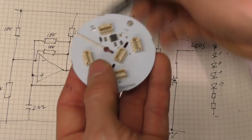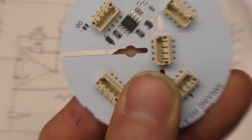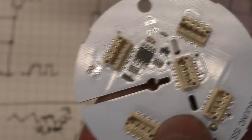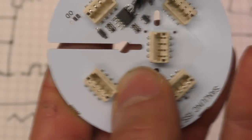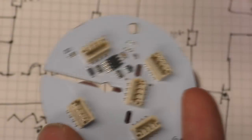So what I typically use in this scenario are these 4-way resistor networks, which cost a little bit more than individual resistors, but the reduced placement cost far outweighs that. So if you can get your resistors all the same value and soak them up into these resistor networks, then that just helps get your cost down in terms of placement cost, and maybe also bill of materials.